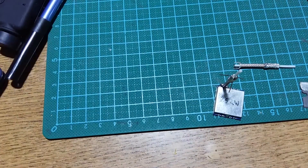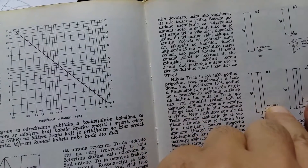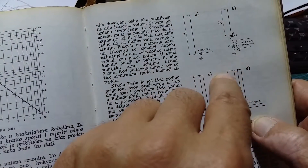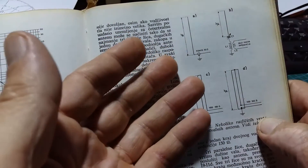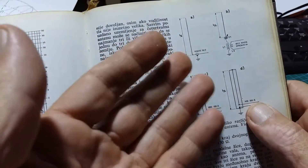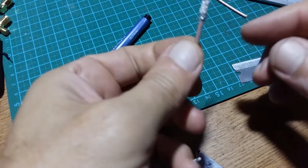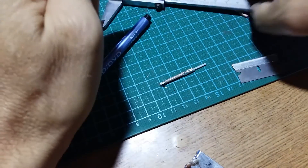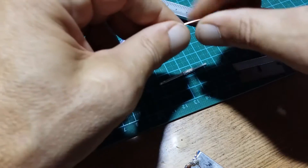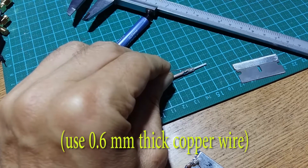Let me explain why I don't like cloverleaf antennas. Here is one example: a quarter wavelength antenna is 50 ohm coaxial cable, but if you put a wire down it is 150 ohms. If you increase even more, put another wire here, it is 300 ohms. Imagine a cloverleaf antenna with three or four elements - this looks to me like 300, 400 or 600 ohms. I rather want to be sure it remains 50 ohms. For this purpose solder at about 45 degrees.